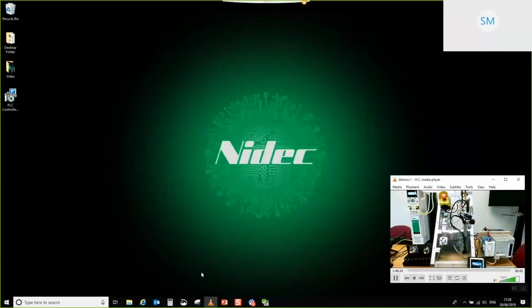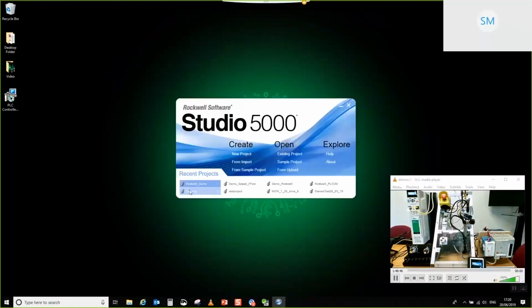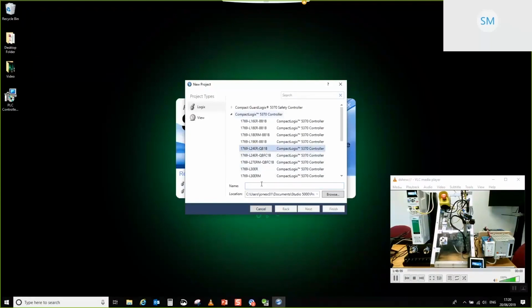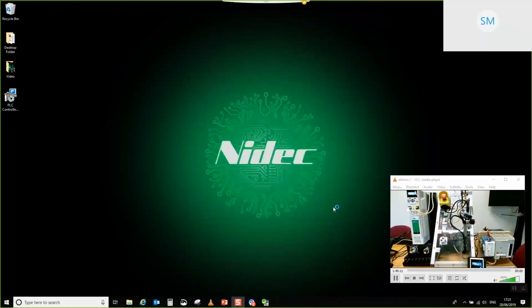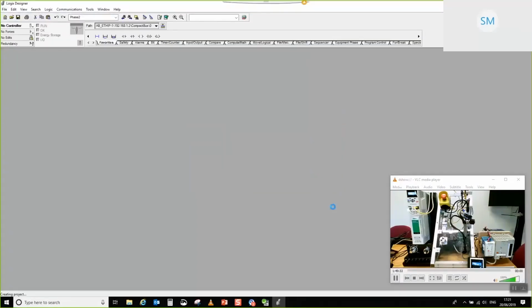So, next phase, let's go and create the PLC project. I'm just going to start my Studio 5000. So I'll just make a new project. This one, and then I will call it Rockwell Demo USA. There we go. And click next. My particular PLC happens to be running 24, so I'm going to configure that particular version of the Rockwell environment. We'll give it a couple of moments to start. It takes a little while whilst it initializes the first project. Nearly there.